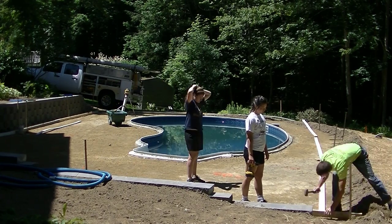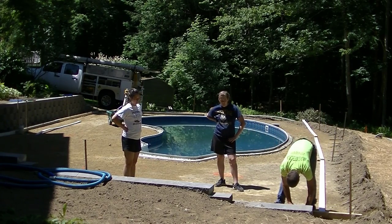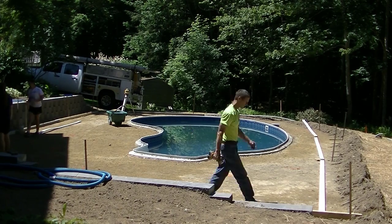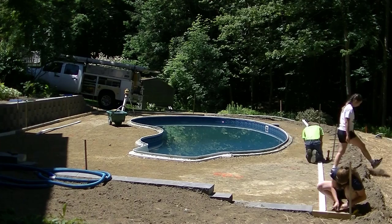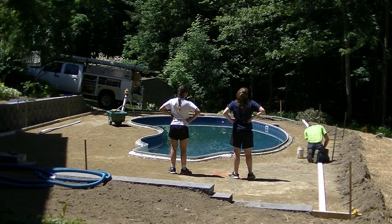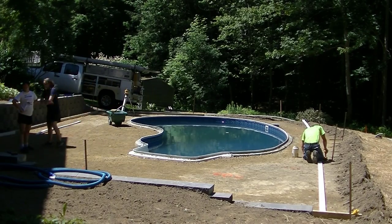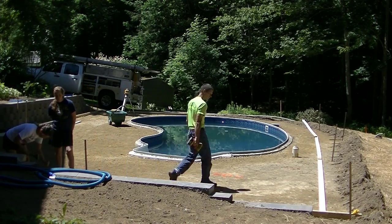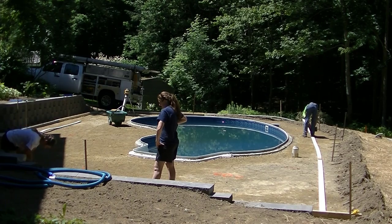This one was kind of unique in that the homeowner had a couple of things going on. He's got a couple of block retaining walls - you can see the one on the left and one towards the front of the screen - and the homeowner wanted the pool deck to be about a foot away from those retaining walls. So when we slope the concrete pool deck away from the pool, any rainwater will have a place to drain off. He'll put crushed rock in that one-foot area and he's also got drainage tile in there. His house is right there to the left, so any water that drains off the pool deck running towards his house will go into that crushed rock and into his drainage.